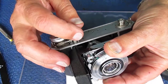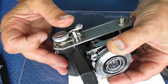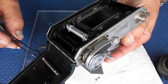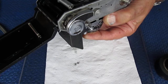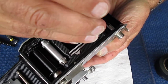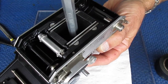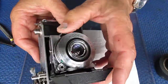Making sure that shutter is sitting firmly, because there's a detent that holds it in place. Try the film advance again — the stroke completes. If I press the shutter release on the camera, the shutter fires. So at that point the shutter is correctly timed to the film advance. Holding it firmly with one hand, flip the camera over, drop the retaining ring in the back. Taking my Bergeon tool — but you could revolve it into position with a screwdriver if you didn't mind it being tedious. Wind that retainer ring into place and snug that up — doesn't need much. The shutter is now in place, focus is still nice and smooth.